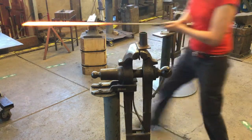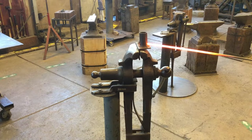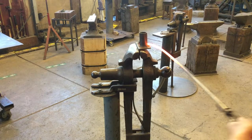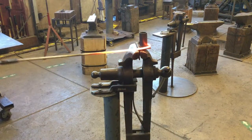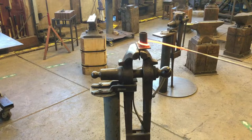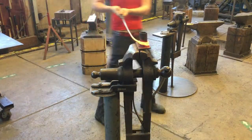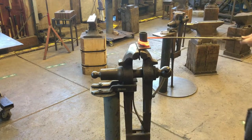In order to make your O-rings tight and uniform, you want to make sure once you lock your post into the jig, you're keeping your bar stock in tension as you wrap around your jig. Tension is what makes your O's nice and uniform.